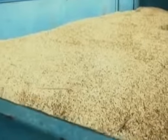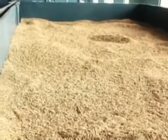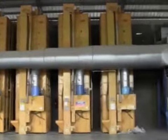One way to dry paddy but maintain high grain quality and reduce losses is by using mechanical dryers. An advanced type of mechanical dryer is a recirculating batch dryer, which is used in large rice mills and processors. However, this type of dryer is expensive because it has many moving parts that need to be serviced, and it often uses expensive kerosene for heating the drying air.